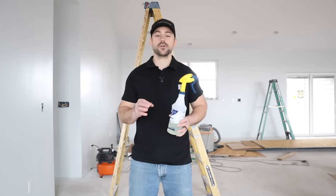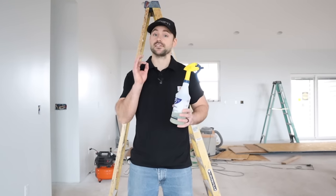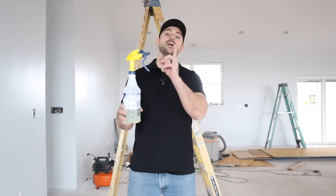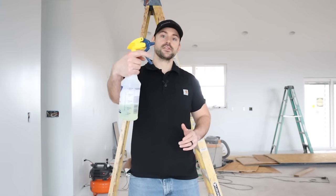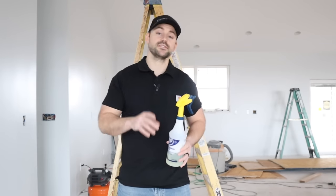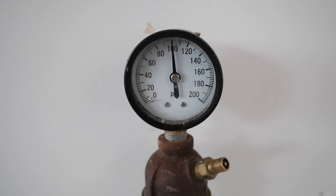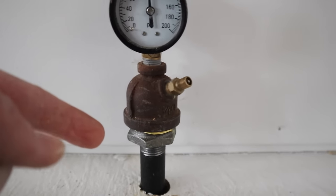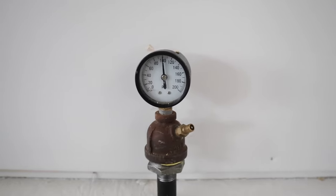It was about 4 p.m. yesterday when we put air in those lines and now it's about 8 a.m., so there's been pressure in those lines for roughly 16 hours — that's an adequate amount of time to detect a pressure drop and any leak. I also brought water and dish liquid mix: if we did have a pressure drop we'd spray soapy water on each joint to narrow down the leak location. The verdict is we did not have a pressure drop overnight — that is awesome. If we had, the first places I would have checked are the temporary fitting and the fireplace cap where we didn't use pipe dope.